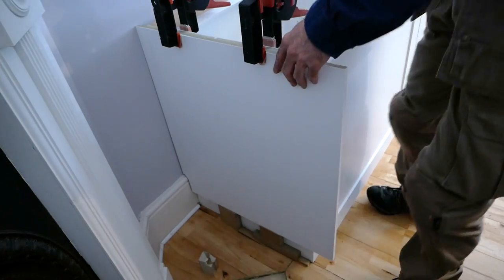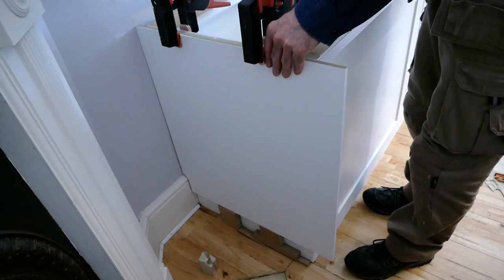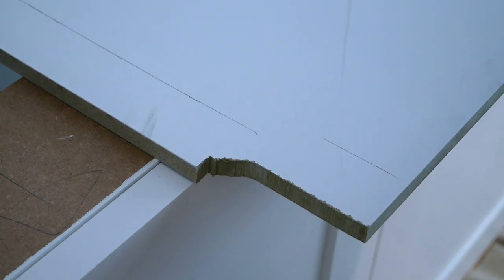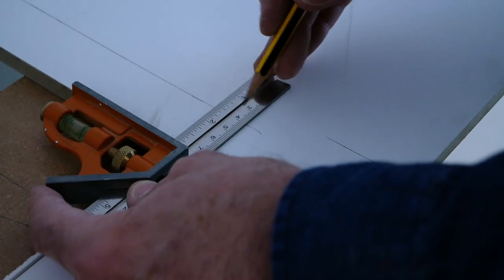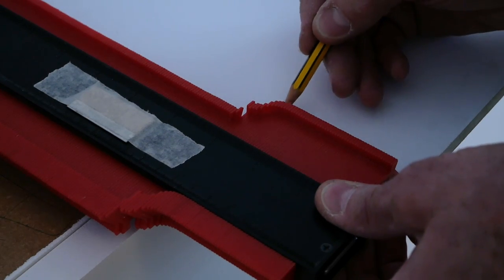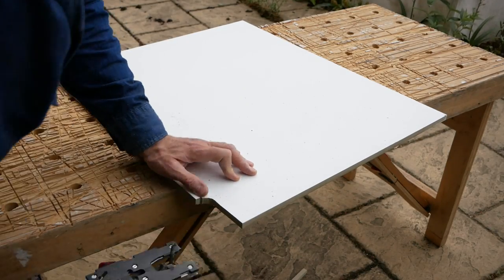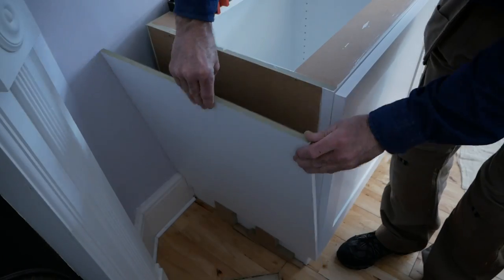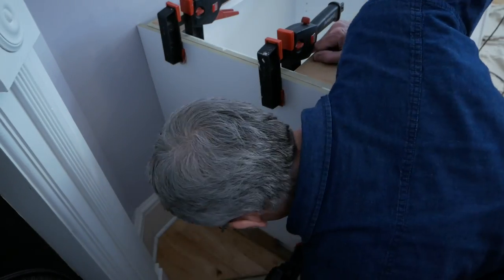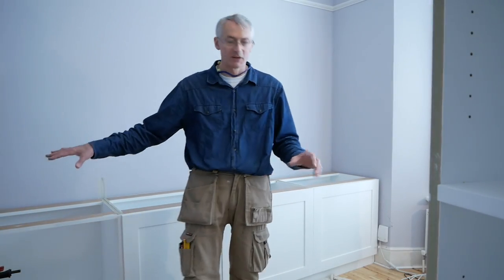We run this down the wall. There's a slight overhang at the top as well, so I'm going to trim that off with a track saw. With the scribe line marked I can add in the skirting profile with my gauge, then take it outside to trim everything back to the cut line using a jigsaw for the twiddly bits around the skirting profile. Back inside I can offer this up as a dry fit, then add plenty of grab adhesive, a few pins, and some clamps and leave this to set.